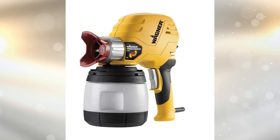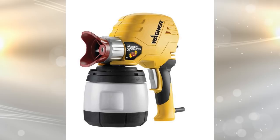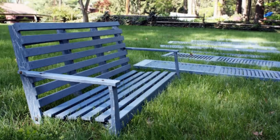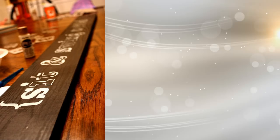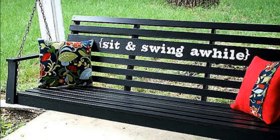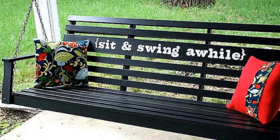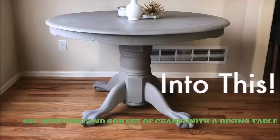31. Freshening Up a Tired Porch Swing — Using a Fresh Coat of Paint and an Appropriate Logo. You will need sandpaper, cleaning materials, a paint sprayer, foam brush, and your preferred paint color. Clean your porch swing, sand it, and clean it some more. In order to stencil a phrase, remove two of the back slats of the swing. Decide on your special message and cut out and measure chipboard letters to fit into the slats of the swing. Use a paint sprayer to coat the entire swing set with your preferred color. Use a foam brush to fix the nooks and crannies. Arrange the chipboard letters into the slat and outline with a pencil. Fill each letter in using white paint. Put the slats back in place and your new porch swing is complete.